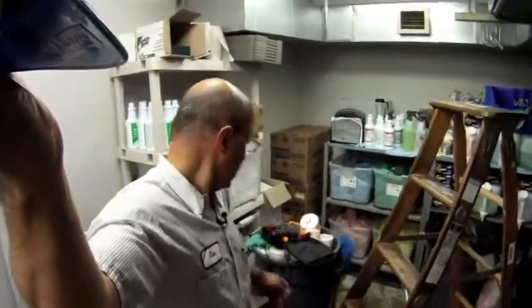All right, so there we have it. We've been able to open up the electrical cabinet, take a look at the transformer that I replaced, all the wiring, get an amp draw on the evaporative fan motor, close it all back up, and I got to do all that without putting on any PPE other than my safety glasses and using my insulated tools and just good practices. I'm able to do that because of the meter I'm using, the 223.